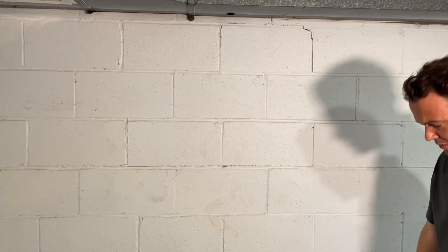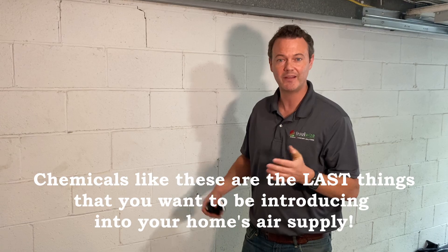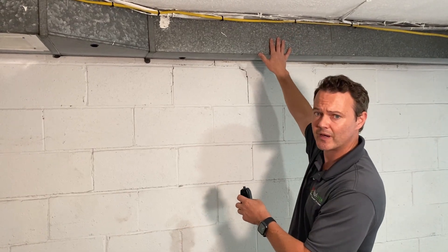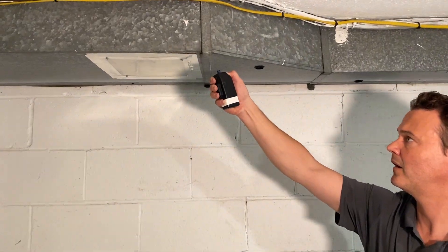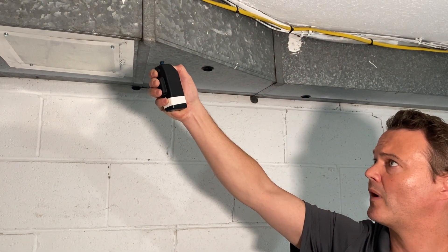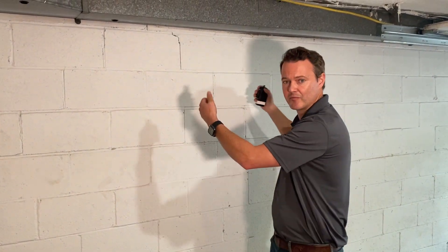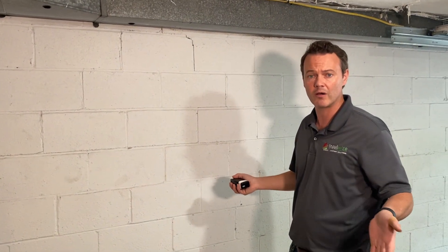In the garage, many people store gasoline, pesticides, and chemicals you don't want introduced to your interior air. Here's our cold air return on the underside of the garage ceiling with sheet metal seams — again, a vacuum source. While the homeowner tries to cool or heat the home, the system is hoovering up air from inside the garage: unconditioned humid air in summer, cold air in winter, all kinds of pollutants, and even carbon monoxide from your car if you're parking in the garage.